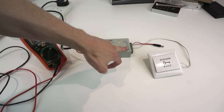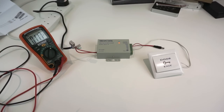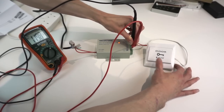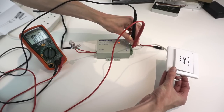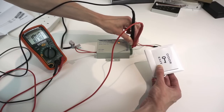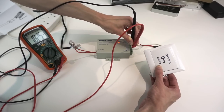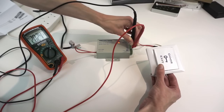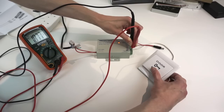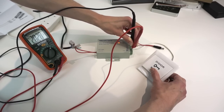On the side there's a potentiometer you can adjust: set it all the way to the lowest and it's instant - push the button, the voltage switches off, let go and it instantly comes back. But you can also set a time delay, which you'd probably want so you can push the button and then walk to the door to exit. If you hold the button down longer than the countdown period, when you let go the voltage instantly comes back rather than waiting for the timer.